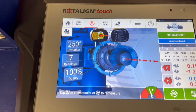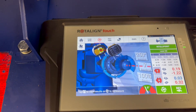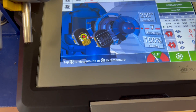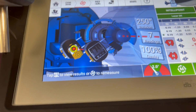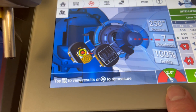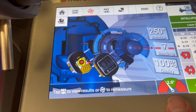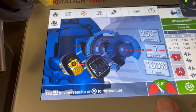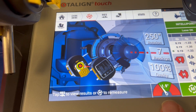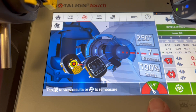To start the measurement, we move the shafts plus the sensors towards us. We can see a needle that shows the difference between the inclinometer of the laser and the inclinometer built into the sensor. It shows we are within a difference of two degrees, so we are still good — the needle is in green — and we can start the measurement as we are.